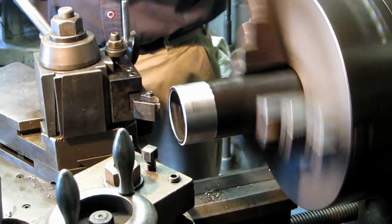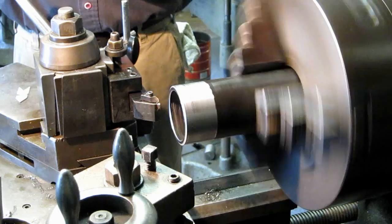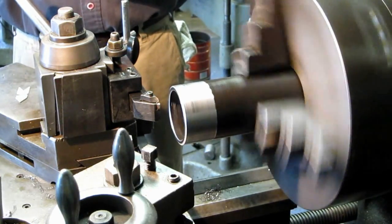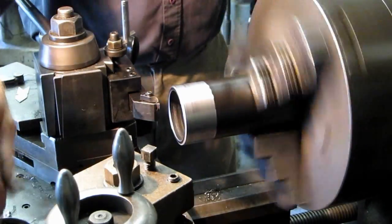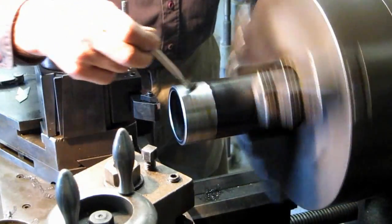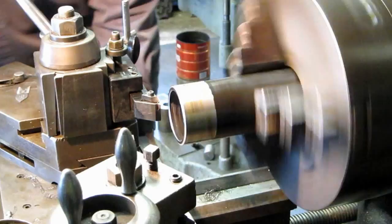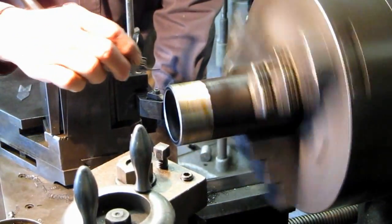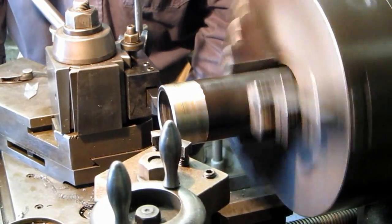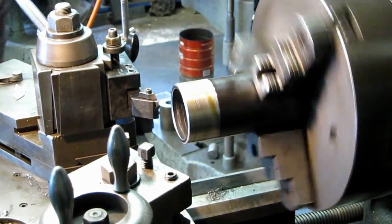Alright, 12 double depth, 108 — so we're going in about 50 to 54 thousandths. We're going to make this a little light because we want the nuts to be a little light; we can always leave a little bit of diameter on there. Let's go ahead and see if we got 12 threads per inch right here. Looks like 12 on the dial. You've got to use some cutting oil and a few other things.